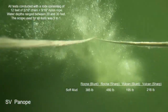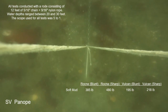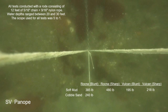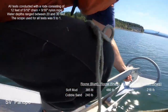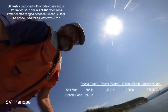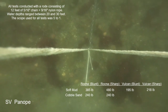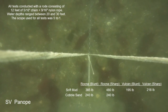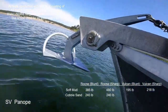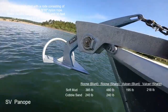Now I've moved over to the cobble sand test site — a seabed with a thin layer of golf ball-sized cobblestones on top of quite pure sand. The anchors always come up clean with no binder or coagulating material. The anchors drag along for 100 feet or more at a very steady load, and it was 240 pounds that the unmodified Rockna would resist. With the leading edge in the sharp condition, it was exactly the same — the same depth, the same 240 pounds of resistance. Absolutely identical. For this seabed, a sharp leading edge on this Rockna makes absolutely no difference.